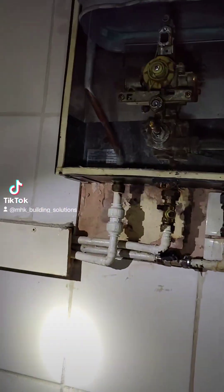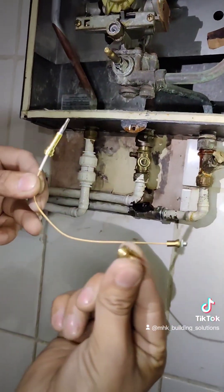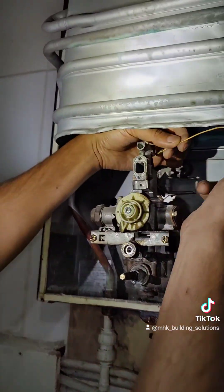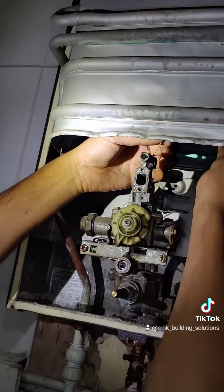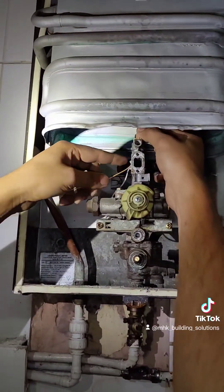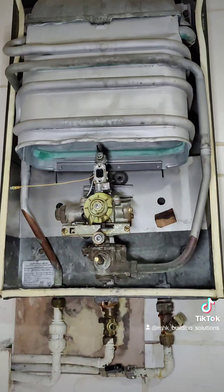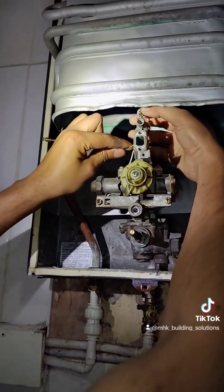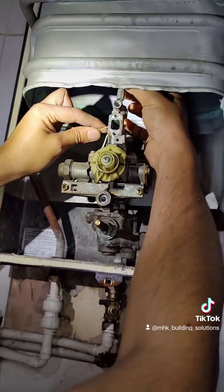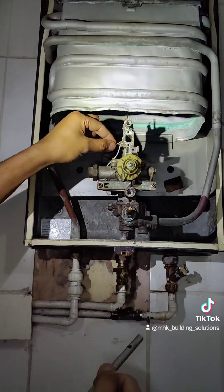To replace it, we've got a new one in the pack from Heating Spares with the part number on it. Take it out of the pack and make sure the new thermocouple isn't damaged before we go ahead and install it. It comes as a single unit with a nut. All we need to do is place it through the hole again from the top, line it up. Get the 7mm nut that's going to hold it in place, use the spanner, and just screw that nut down. Once tight in place, as you can see, it's not going anywhere.